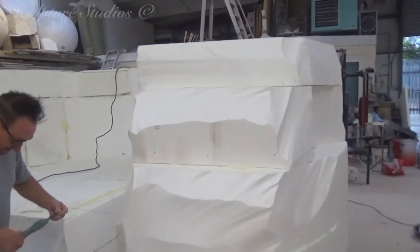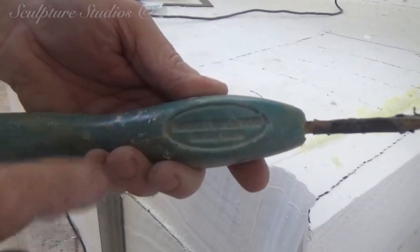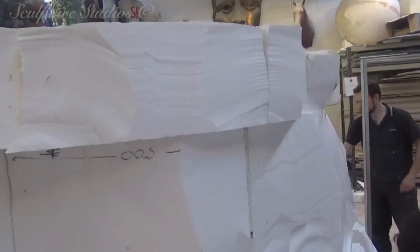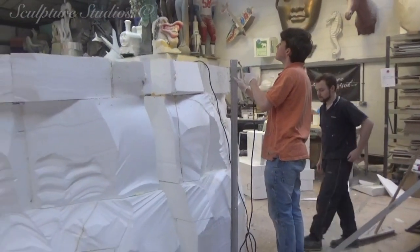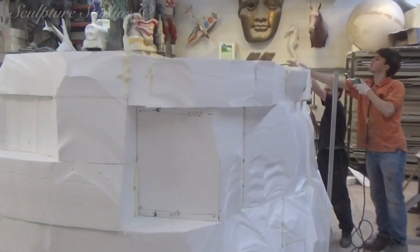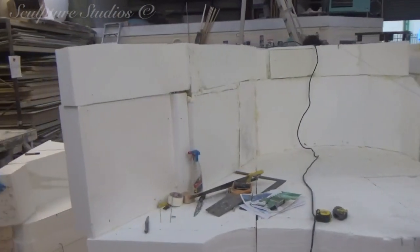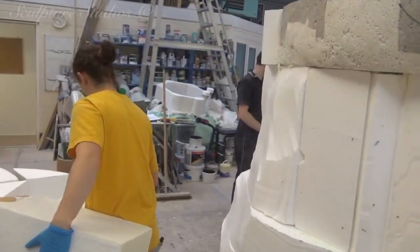All this is added together using a polyurethane expanding foam — even got Sculpture Studios branded on there. All stuck together using the PU squirty foam, and then we trim all this off afterwards. Then Aiden's going to go to work with nail brushes, wire brushes, and work down to sandpapers to hone the shape down. Once we've sent images to the client so they can confirm everything, we're then going to start going over with our secretly sourced sticky-back tin foil, and then a blanket coat of glass fibre. This doesn't need to be a car body finish as it's going to be rock and sand. We'll go over with a flow coat of resin, work up the surface so the kids don't hurt themselves, and then artwork accordingly.